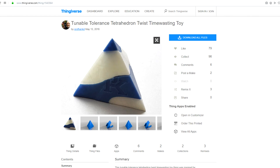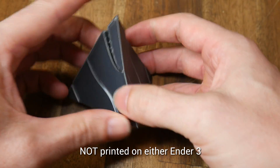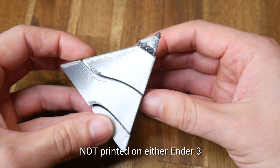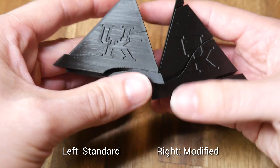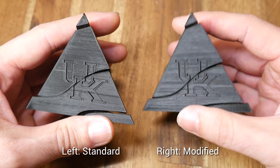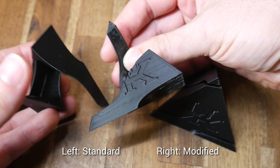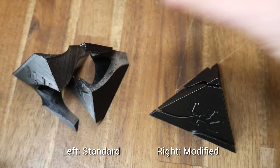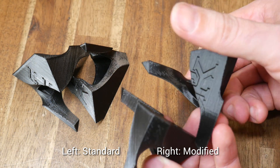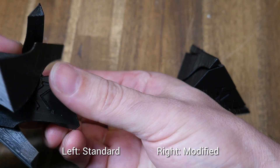Next up, a tolerance test. The gaps between the parts aren't actually that small — the difficulty comes more from the fact that they're all overhangs. On another printer shown for comparison, the part cooling is not up to scratch: there are artifacts and the parts actually fuse together. When I tried to separate the two halves, I had a breakage. Both of my Ender 3s outperformed that other printer significantly. The two halves of the pyramids try to twist apart simply from holding them, and when twisted apart, the underside of the overhangs has no wispy bits that would fuse them together — only some zits from where new layers start. This is the same for the model printed on the modified Ender 3.